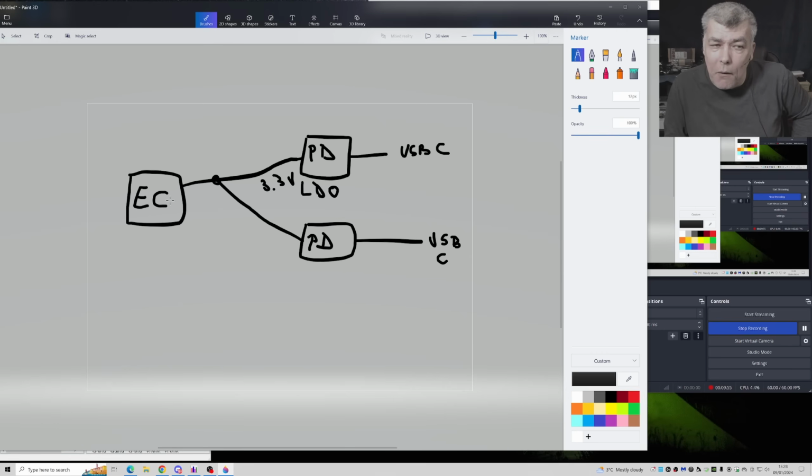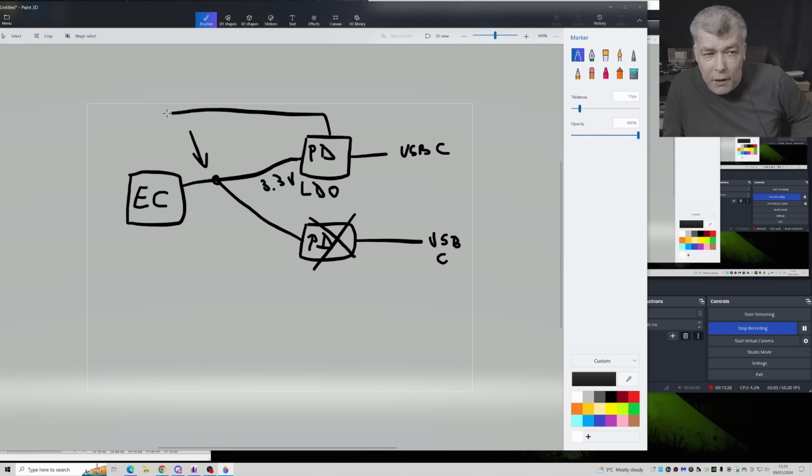So basically, what we found on the EC chip, if I remember, was very low resistance or shorted, something like that. Anyway, the 3.3 LDO was missing. When I came with the power supply with 3.3, I remember this chip was getting mad hot. Good. Now, one more thing about the PD controllers: they are speaking digitally with the EC chip, with a bidirectional communication.